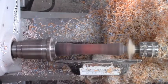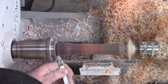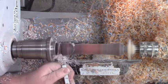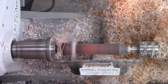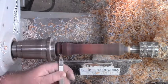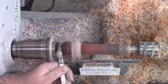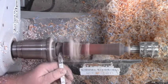When I stop this you'll get to see all the cool swirls. Right now I'm cutting the tenon, and I like to use the EasyWood detailer to cut a nice big section for the tenon. I find it easier — when I go to do resin I can just use a saw or a parting tool and cut that off. I just kind of shape it out here, and that's a pretty easy way to do it as far as making a wide enough gap for a saw or a different tool.